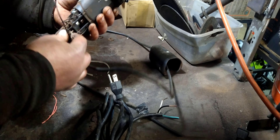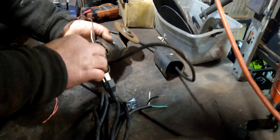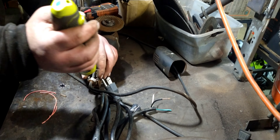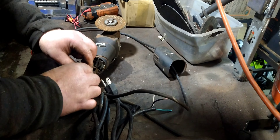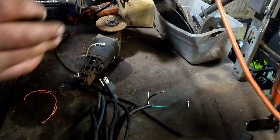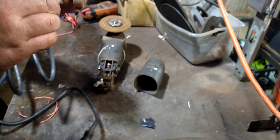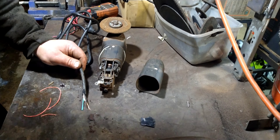I have just punished the heck out of these. What you want to do, especially if it's the first time it's breaking, is follow where the power cord goes up and see these wires — they go up through here and connect to these terminals here. It doesn't matter if you wire it reverse polarity or not; this thing will work and go the same direction. The connectors basically break to where they're not making contact anymore. You can eliminate those through-hole connectors and just straight splice — open up your copper wire, wrap it around the screw like that. I'll show you a little better here.